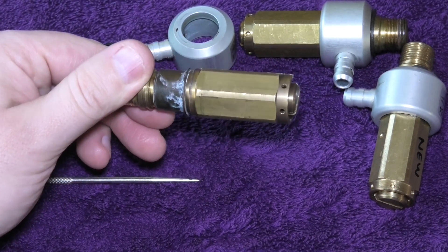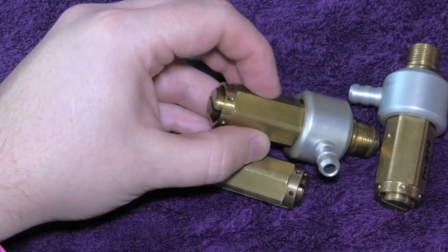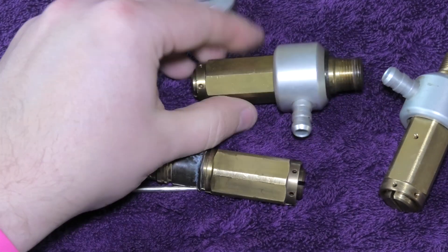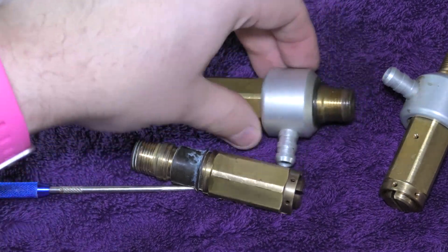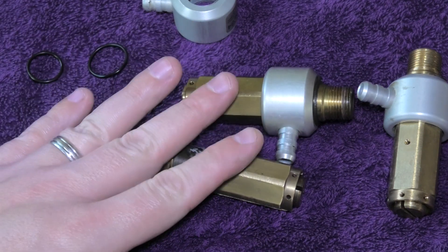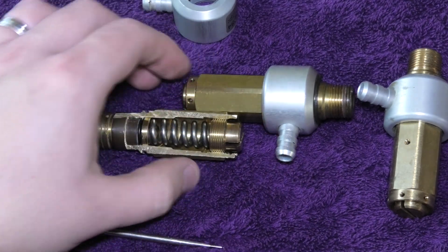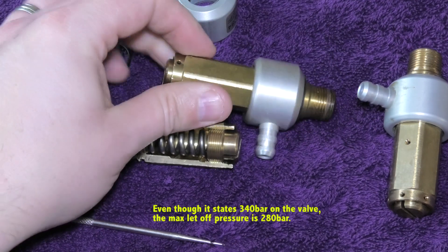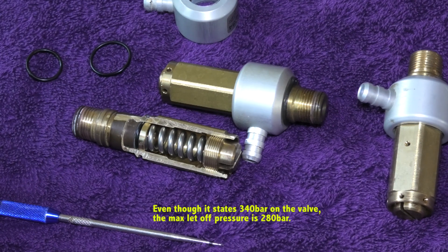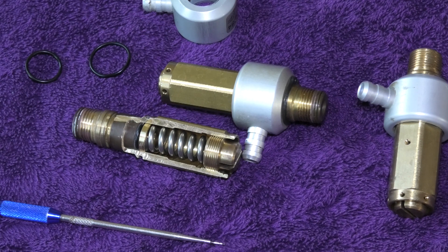These are not overly expensive — they're about 35 quid and they're very easy to replace. They literally just unscrew. You just get a 22mm socket or a spanner on the end of them, unscrew it, a little bit of blue Loctite on the end and throw a new one in. You may have to readjust it. They're not really to be toyed with. If you've got a 250 bar pump and these are rated at 280 bar, you could technically wind this all the way in, maybe back it out a quarter, half a turn, and that should be almost spot on.